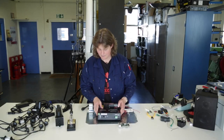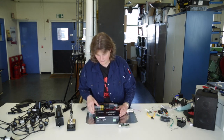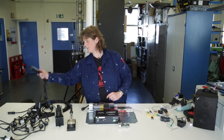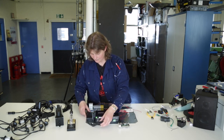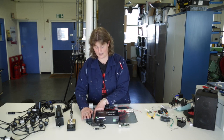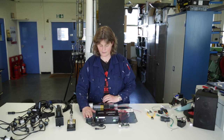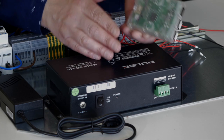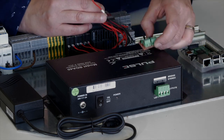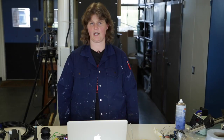I'm now going to put most of the parts on the board, at least lay them out to make sure that everything will fit properly. I've got the amplifier, lining it up with the holes that I've already drilled. This will be the power for the amp — that's going to fit there and these holes will have cable ties coming round to secure that down. So that's going to be screwed down, that's going to be cable tied down. The Pi I'm going to put adhesive on the bottom and stick that down there, and the thingatrons are also going to have adhesive little feet. I've now got my Raspberry Pi plugged straight into my laptop via the ethernet port.